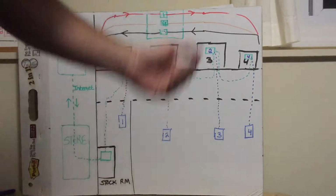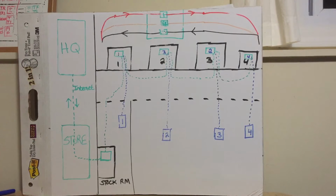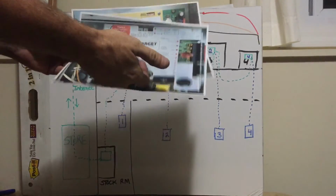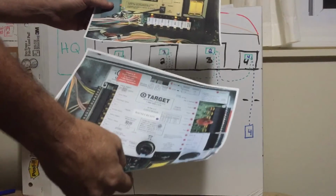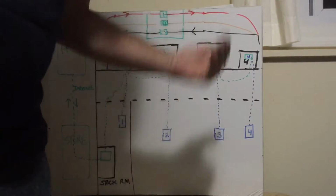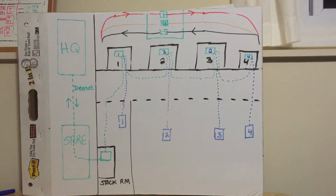So the myth: when the office calls and everyone's panicking because they just had a whole store in comm loss, the assumption is the whole store is down, the lights are out, and everyone's going to die from heat stroke. Complete myth, everyone. These units have built-in programs just like a thermostat. The only thing that has happened is Target, Home Depot, or Ulta can't talk to the units. They don't know if they're running or not. They don't know what the program is. They don't know if the lights are on or not. But the units run on their own.